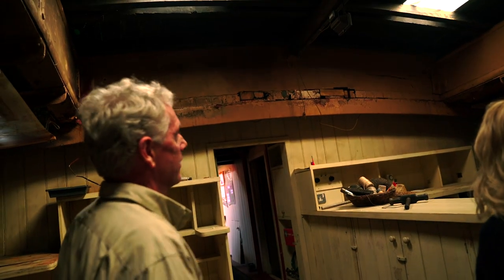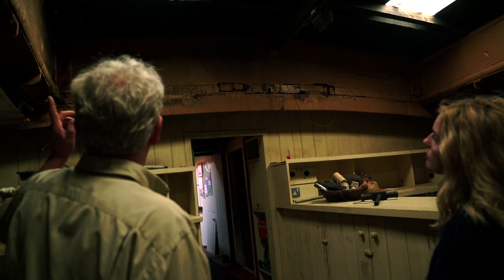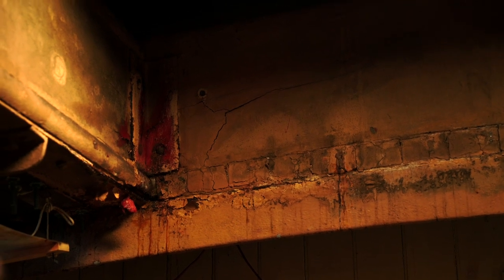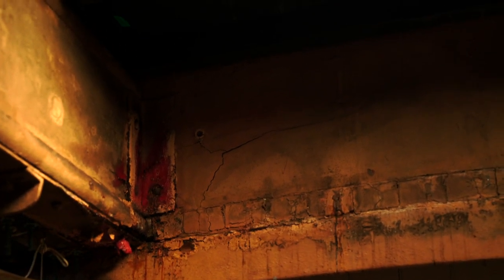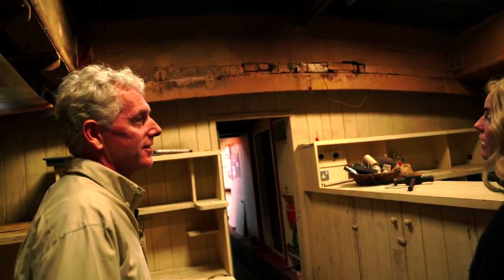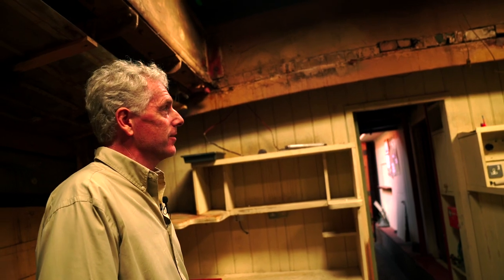It's an extraordinary kind of huge dovetail that locks the timbers. Is the deterioration because of the elements or the weight? It's certainly the fresh water that rots it, but when you have a boat which by its nature will flex — the whole hull will flex, especially with 150 tons inside in a big sea — part of their strength is that they can move slightly. They were built with a good life of 25 years of hard work, so it's worth remembering that when you look at how well they've lasted — this is 100 years old and it's still remarkable.